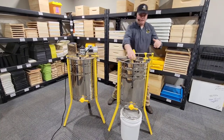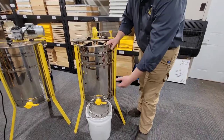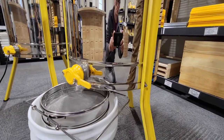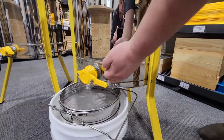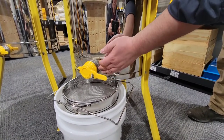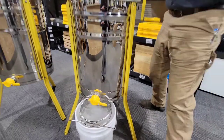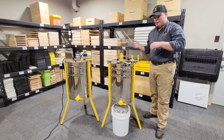So we'll talk about the honey gate design on these guys. A lot of our competitor machines — almost every competitor — their honey gate is raised up a little bit inside the tank. There's about a half inch lip or so that you've got to either tip the tank clear over or kind of scoop out the honey with a spatula. Whereas ours, we mount our gate down lower. The gate valve is mounted just a little bit below the floor of the tank, meaning all your honey is going to drain with no obstruction inside the tank. The tank is also coned in the center, so it flows all your honey towards the outside edge and then it all flows around that gate — no obstruction, no tipping your tank, no having to spatula honey out.